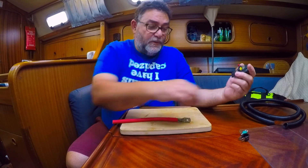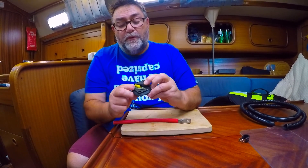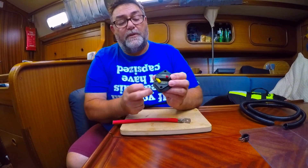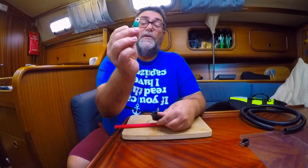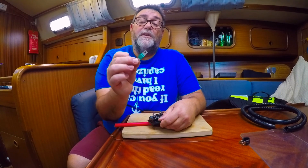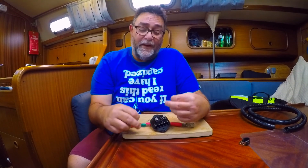Lastly, I just want to quickly talk about circuit breakers. I like to use these waterproof ones that have a little flag that pops out when it trips — easy enough to reset, and you can do it in seconds, even in the dark with a torch. The other option is fuses, but a disadvantage of those is the mechanical fix — they're bolted on and hard to change in a boat that's rocking around. So this is always the better option.